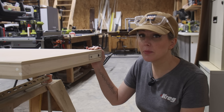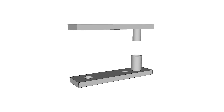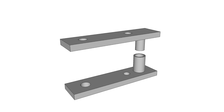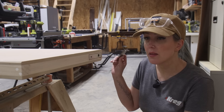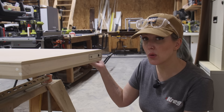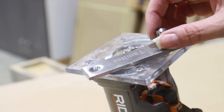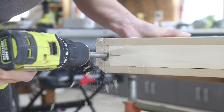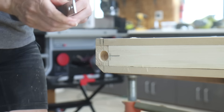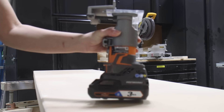The hardware I'm going to use is basically pivot door hardware — I found mine on Amazon for less than 50 bucks. Each hinge is basically one plate with a hollow barrel and one plate with a stud that fits inside the barrel, providing a pivot point. These special hinges are concealed within the side of the door, so you won't be able to see them from either side. Each plate is about 3/16 of an inch thick, so to minimize the gap between the casing and door I want to inset those plates within my door — that means I need to cut what's called a mortise, which I'll do with my palm router.